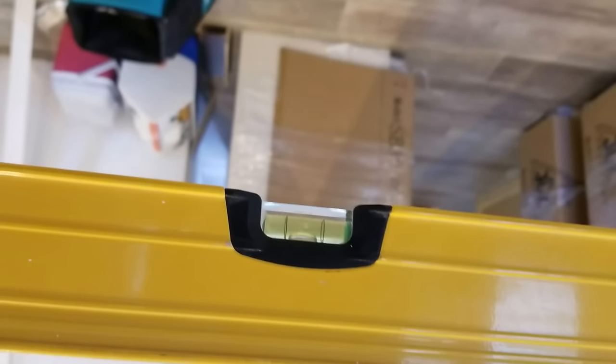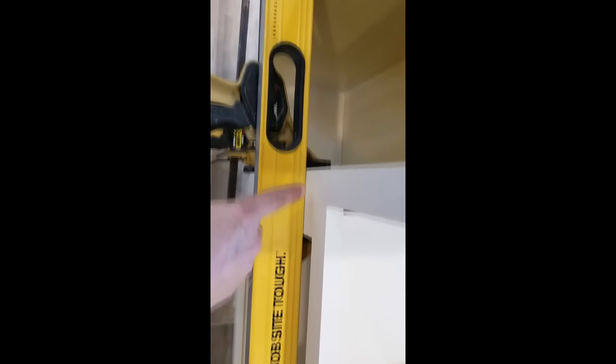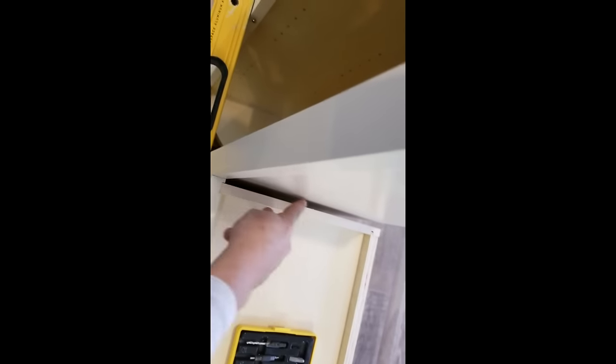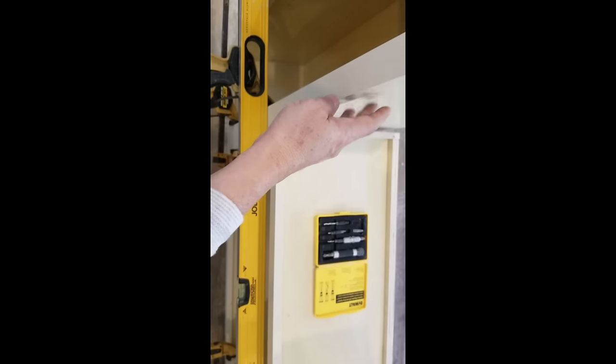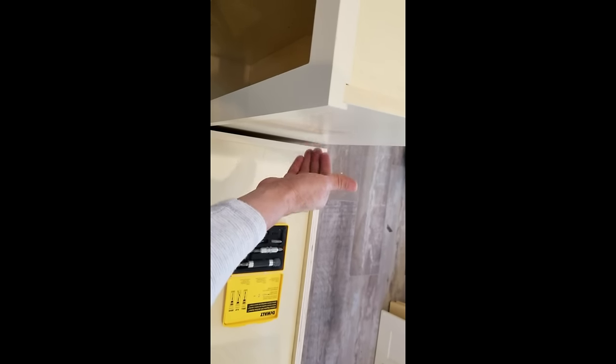You can see how level the floor is — the cabinets are sitting straight smack dab in the middle. It's very important that the entire front face of all these cabinets is exactly flush — no lippage, like you'd worry about when tiling a floor. To achieve this, you want to make sure each cabinet is square. We're cutting up biscuit spacers of wood to stick in the back to maintain the correct distance. Otherwise when you go to hang the cabinets they'll flop around. We like to go completely through a piece of wood and into the cabinet.